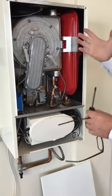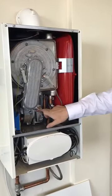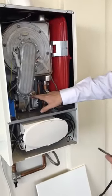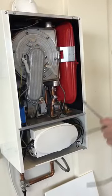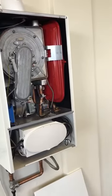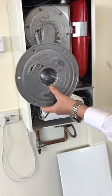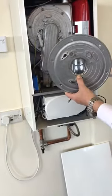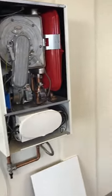So if you're analysing a boiler of the pre-mix type and you've got a poor reading, before you start to alter the throttle for the CO2 percentage — on this boiler it's 9% by the way — before you go to that, you must check the burner. You can take the front off here and give it a vac out, you can take the whole lot out, but always make sure that you check that the burner is clean. Because what can happen, if we look at the burner that passes through, you can end up with a high level of debris across the bottom end of the burner.